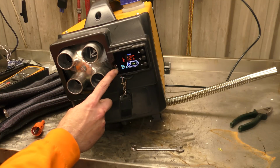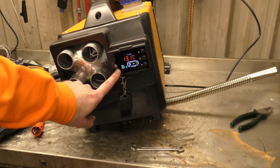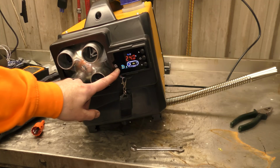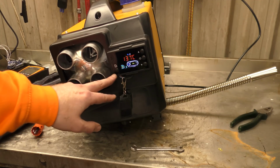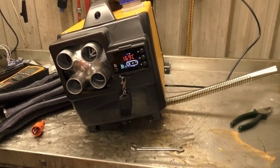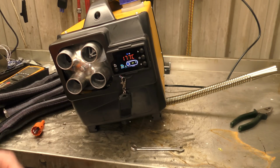Right, if I press this button now, can you see on there, it's got a body temperature 130 degrees, voltage 24 volts, 24 volts, and the temperature reset, which is 12. So let's see what body temperature this gets up to before it ticks over. I'm going to guess 150. Okay, I'm guessing the tick over point was 170-ish degrees because it started to slow down now. Temperature's still going up in the housing, but I can hear the fan starting to get slower.